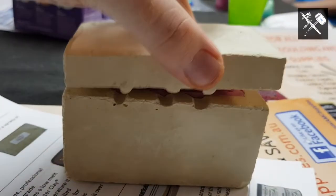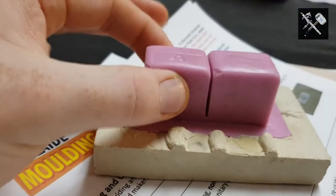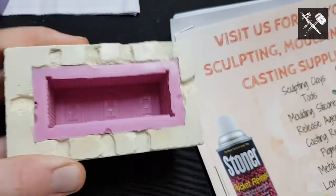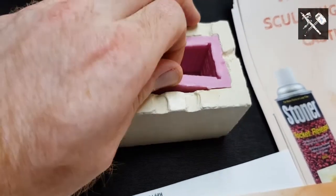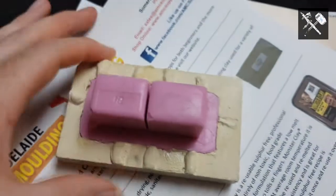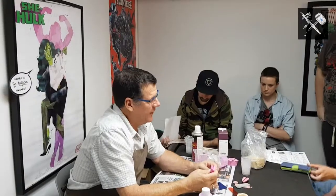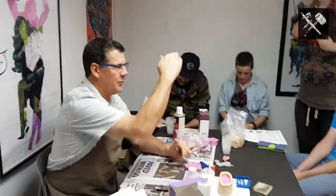As you know, the other good thing about this is when we pour our resin in, we need to either put a weight on the top or band it up. Now when it's soft and flexible, we band it up. As we said, it's going to compress. The great thing about this is that I have made with relocation points in the plaster. Okay, we put this together, and what do we got? We've got one solid unit that we band up once we've poured our resin in, and nothing's going to distort it. Yeah, the advantage of being able to lock everything solid without it distorting is obviously in the case of this sword blade, we want it straight. We don't want it with a woof off to one side or whatever.